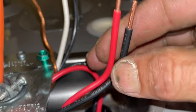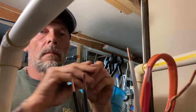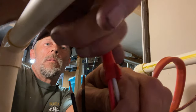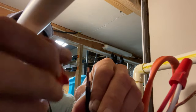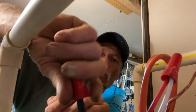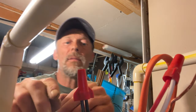Red to white — use a good wire nut to catch both wires securely. Before you start tucking anything, make sure you get both sets of wires tied in with wire nuts and confirm they're nice and tight. Do not substitute wire nuts with electrical tape — take the time to get the right materials.